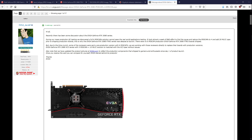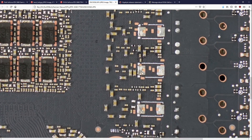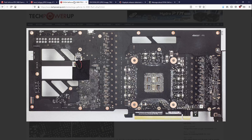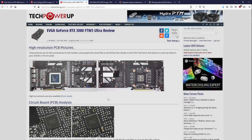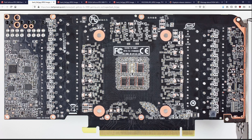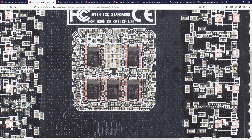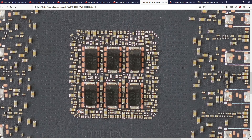What I find really interesting about the statement from EVGA is that if we look at the pre-release board and then the final retail version, and then a reference card — looking back at the pre-release board — it's like, wait a minute: 220, a bunch of multi-layer ceramics, another 220, 220, 220, 220. I think this might just be a straight downgrade. This might be one of the first RTX 3080s I've seen where this is a straight downgrade, because most of the other cards actually go for higher capacitance SP caps.